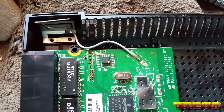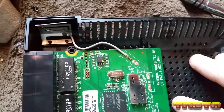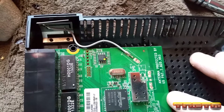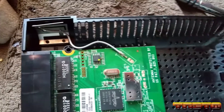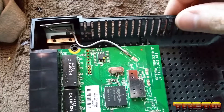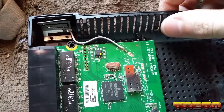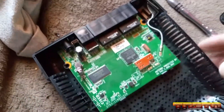So to summarize: you have 32 megabytes of RAM, and a one-core 300 megahertz CPU. This is running a really, really tiny Linux-based operating system just based on networking. Throughput-wise, at 300 megahertz you'd be lucky to get 100 megabit out of it.